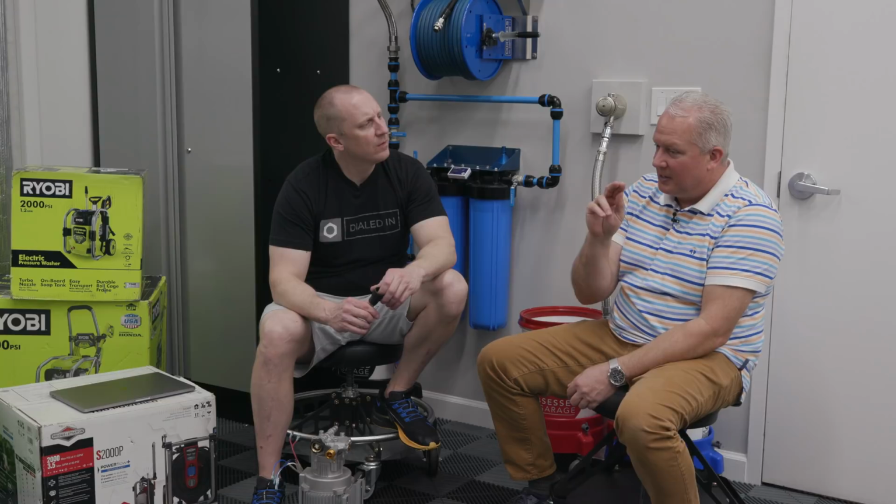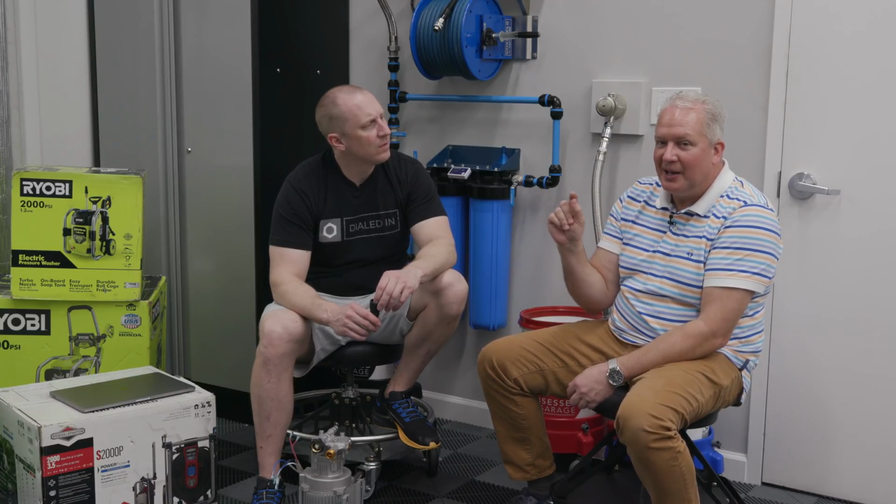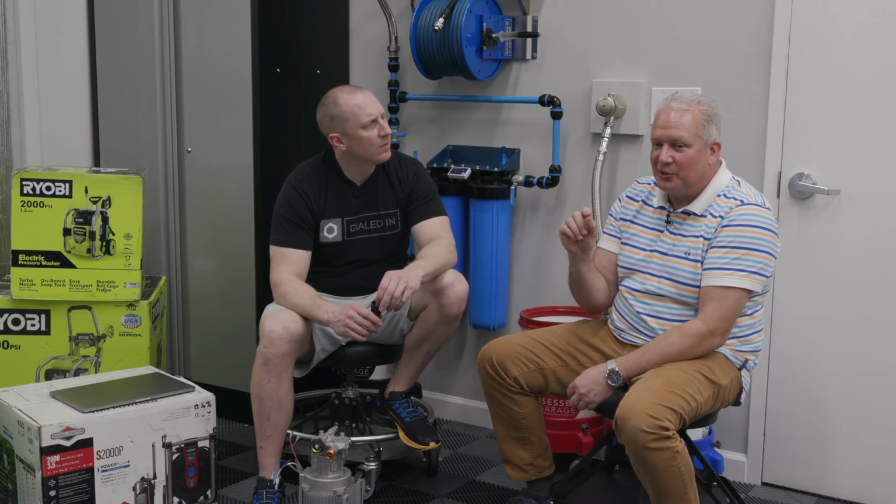So again, the standard basically just says that your first 2 numbers are going to be the width, right? 15, 25, 40, and then the next 3 numbers are going to be the 020, the 025. I think the reason there's 3 digits is there is some giant nozzle that's a 12.5. Yeah. So you'd have 40125 for a 12.5 gallon. So that's kind of coming back to your question.